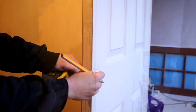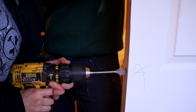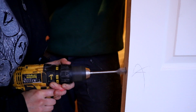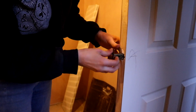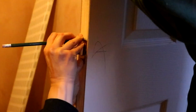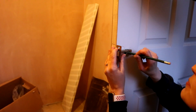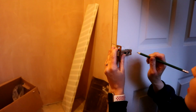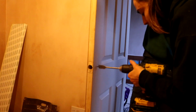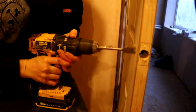After a pencil line was put at the edge of the door, I needed to work out the centre point so I could drill with a hole saw to put my latch in. This is a size 25, although I found I probably need new ones — I don't know how to sharpen them and they just took ages to cut through the door. Once we drilled through it, we put the latch in and then with a really sharp pencil or sharp knife, I drew around the latch to create a groove so I knew where to chisel out. I then held the latch against the edge of the door, penciled inside the hole where the door handle bar goes, and used the hole saw again for that pencil mark. Once through one side, I went onto the opposite side to finish the job.